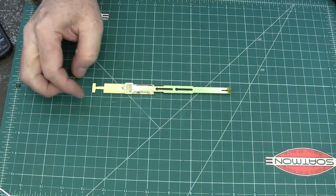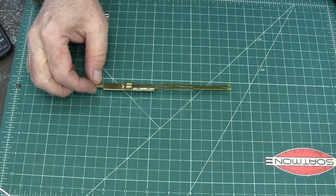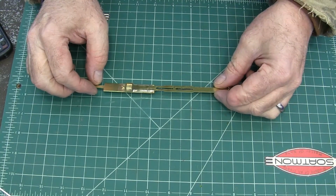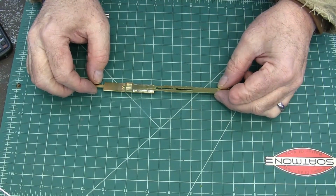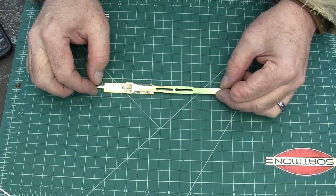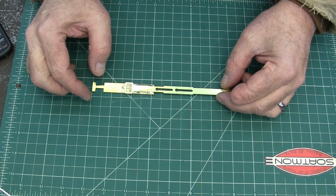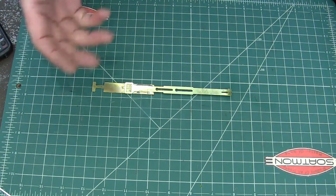So if you've been watching my channel the last few weeks, I've been working on a grandfather clock that was my grandfather's and putting a new movement into it. The pendulum length on the original clock was 116 centimeters, and I bought the new one and it said the pendulum length's 114 centimeters, and I thought, okay, I'll probably have to cut the pendulum off 2 centimeters, which wasn't a big deal because it's a wooden pendulum.